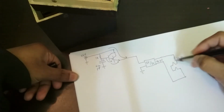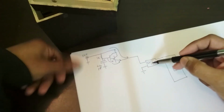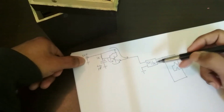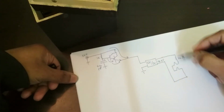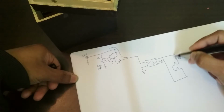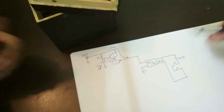So although the steady state current of these is low enough that this buck converter, as well as my 24 volt adapter, can supply that amount of power, the initial current is very high. So this is there to limit that, because otherwise the circuit was shutting down. These power supplies were not able to handle that.